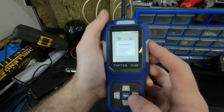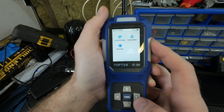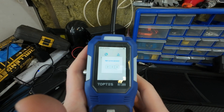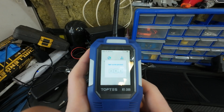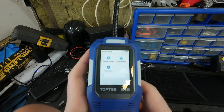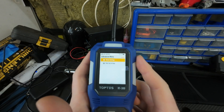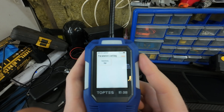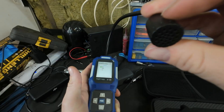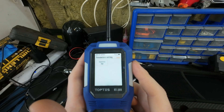There's an advanced menu — the system password is 2-2-2, and you have to hold the function button after entering it. Now we can go into the sensor settings, and it's on high right from the factory. You can go medium or low. Keep it on high, but please be warned — experience tells me when it's on high, this thing will react to undercoating. It doesn't matter who makes it; there's something in undercoating when the sensitivity gets pushed to the max that really affects it unfortunately.